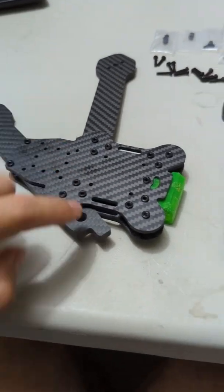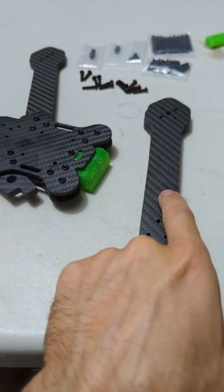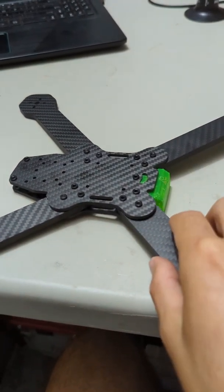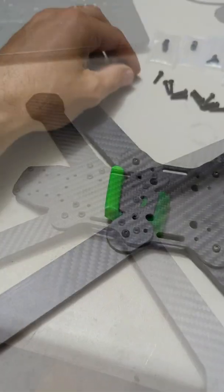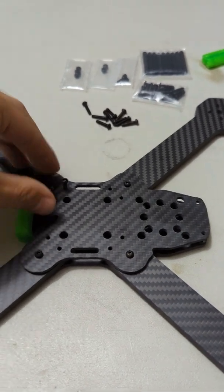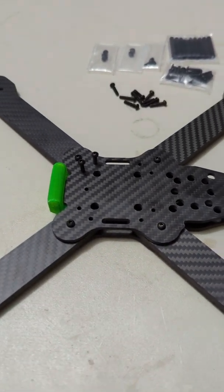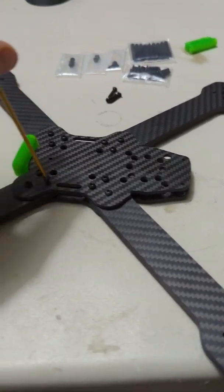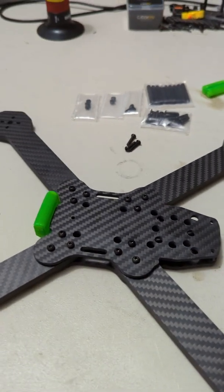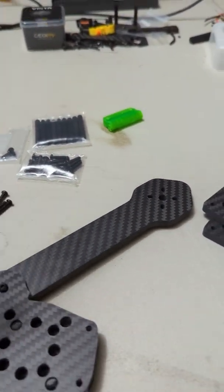Now because the arms are loose and can pivot, we can check the direction of our locking mechanism. Both of our arms need to be installed with the correct face up. It may take a little bit of wiggling, but once you have them they should just slip right in and all the holes will line up. Now that I have the four arms installed with their outer mounting bolts, I can slot the rest of the bolts in and thread them into the press nuts. We're not going to tighten everything yet — it's best practice to get the whole frame assembled first. You'll notice you have three more 14mm screws: one goes here to lock in the front link, and the last two attach the rear link to the frame.